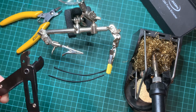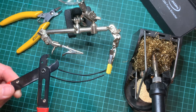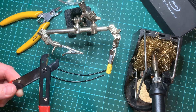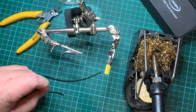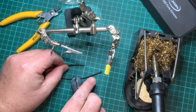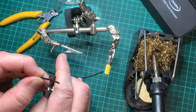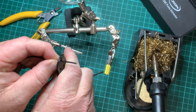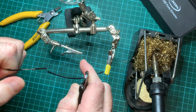The first thing we're going to do is use some wire strippers. There are different types of wire strippers you can use, and also different gauges to take the shields off a wire. I'm just using a very simple pair of wire strippers. What you'd like to do is strip about two centimeters — find where two centimeters is roughly, place the wire strippers on there, give it a little twist and then pull the shield off.